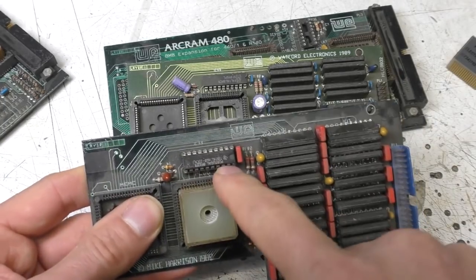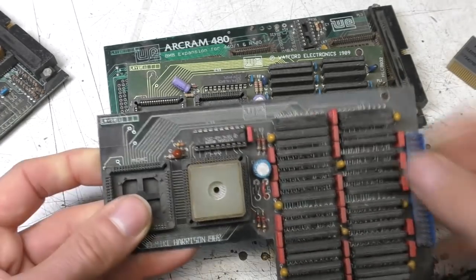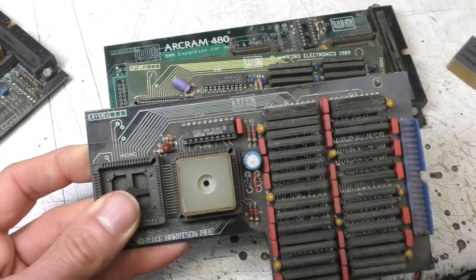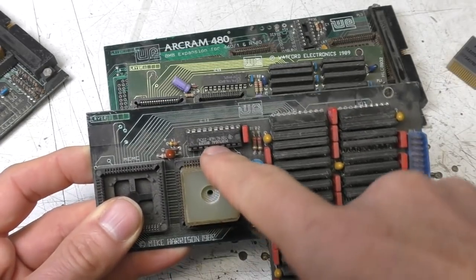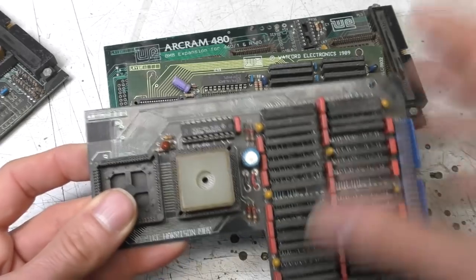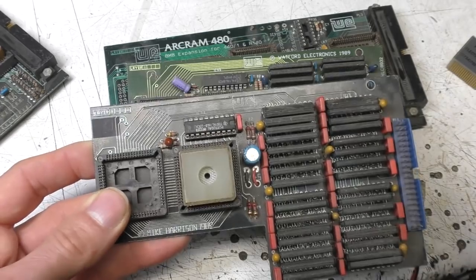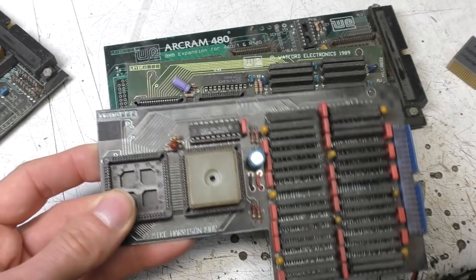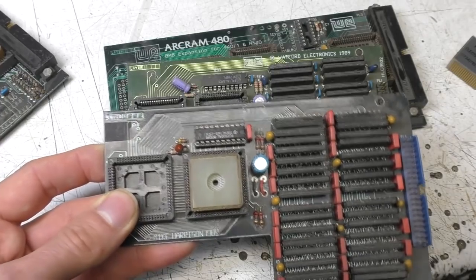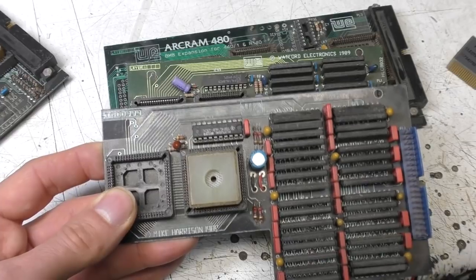One additional thing I put in there, which I think was unique, is that there were quite a few companies making different memory upgrades, but I don't think anyone else did this: the ability to software disable the expanded memory, so you could effectively downgrade to what the original machine's memory was with a software command. The reason for that was so that people like software developers could check that their software would run on the lower end machine. At that time there were machines out there with 0.5 meg, 1 meg, 2 meg,